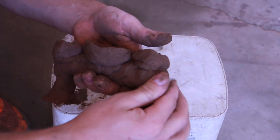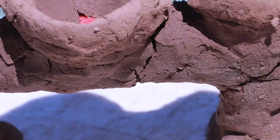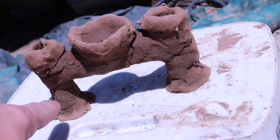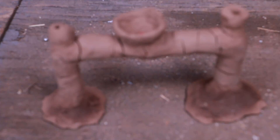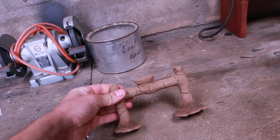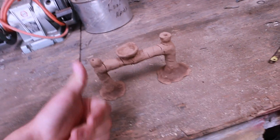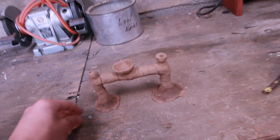We'll just let this thing dry. The mold is starting to crack, so I think I'm gonna break this mold off and re-apply a new one that's much thinner. I'm thinking this one will have a better chance of survival. I tried it and it cracked again. I read online and I think what's happening is the clay is drying too quickly and cracking. We're gonna rebuild this — third time's a charm — and then control the drying with a plastic bag over the top.